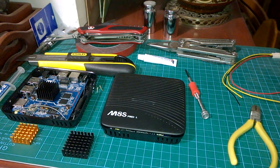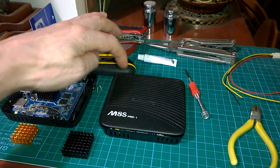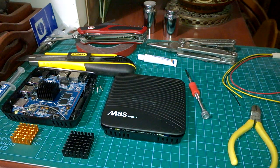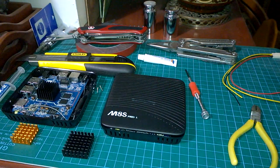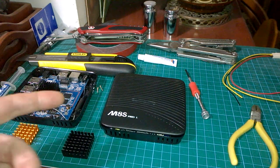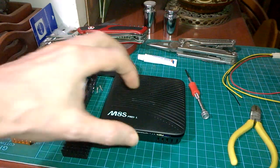So what I decided to do in the end is put in one of the Pi 5 volt fans. I was going to take the power from the USB but it runs too fast and makes a noise. What I did instead was attach it to 3.3 volts - at 3.3 volts it only uses about 50 milliamps and runs at just the right speed to be silent and yet keep the thing cool.